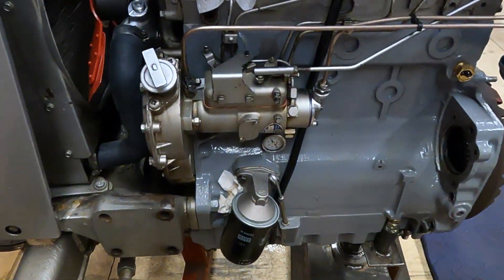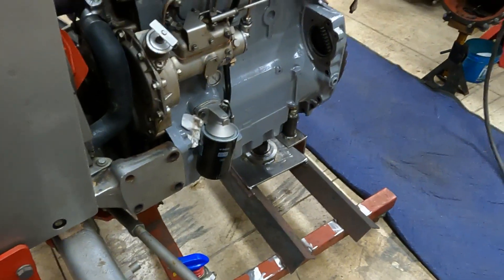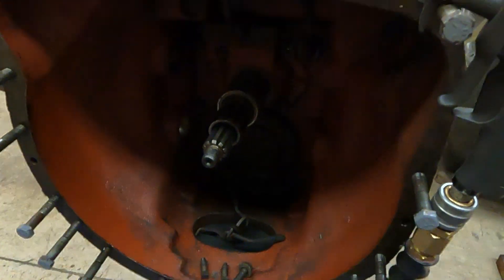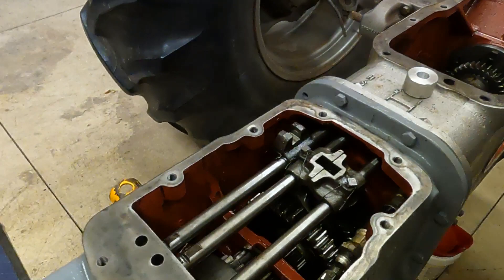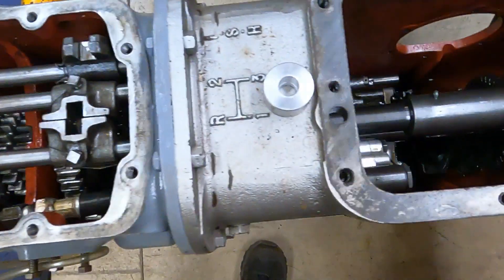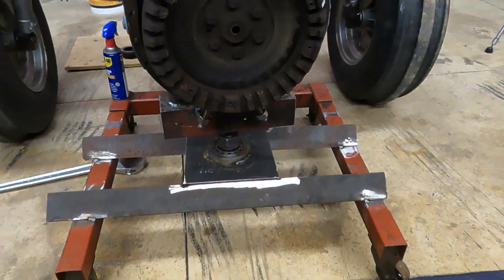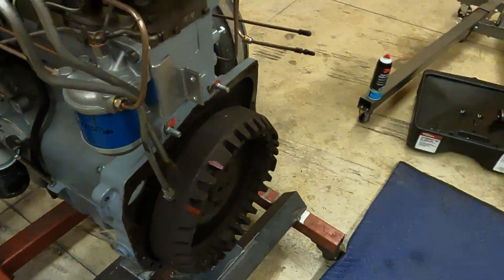I did get into the pump on this tractor, gave the distribution plate a full revolution, and it does run very well. I'd like to make this multi-power go — don't want to gut it before I have an idea of what I need to be looking for. Waiting on some filter parts and clutch parts, and from there we'll see if we can get this thing back together.